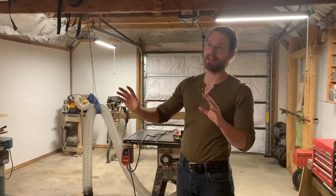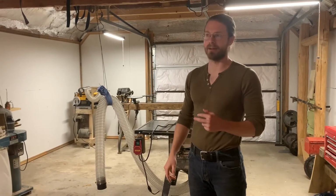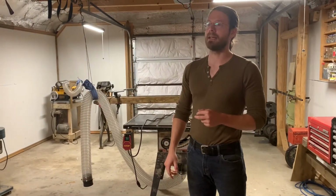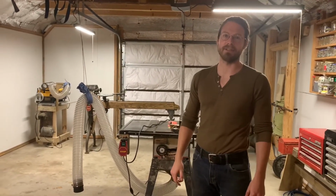Bubble wrap. It's R2, unless it's in a place where there's a lot of radiant heat, like in a place heated by a wood-fired stove. And in this case, it's quite a bit more efficient than R2, so it adds to the resilience. And just so people know, there's actual traditional insulation behind it. Yeah. So this is just the cover.